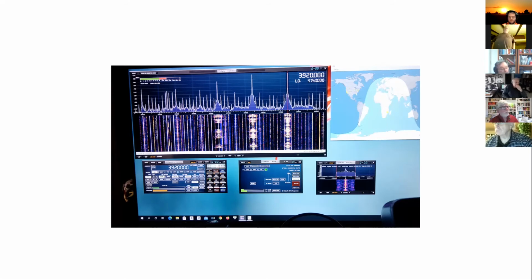Yeah, okay, I'll definitely check, because my next step was to make a broadcast interference filter, which is basically a high pass filter that cuts out below 1.7 megahertz, the top of the AM band. But I'm going to do what you said and see if I can find something, like a rusted or corroded part somewhere around there that might be causing this.